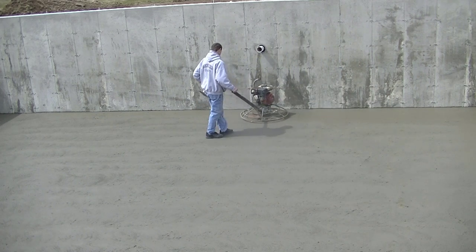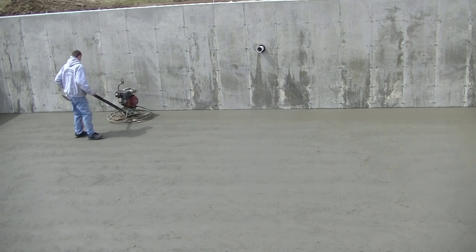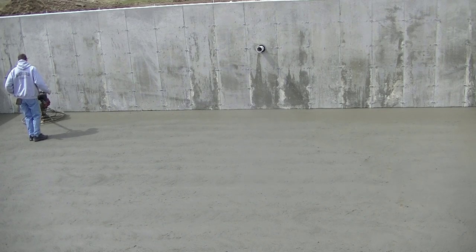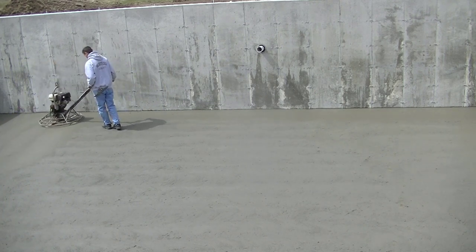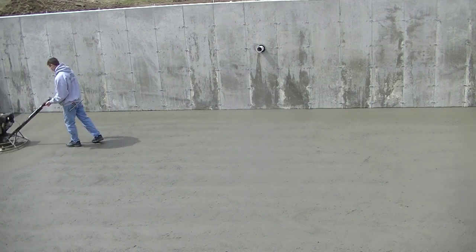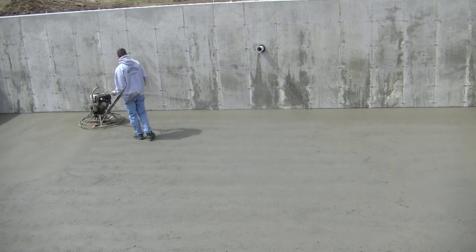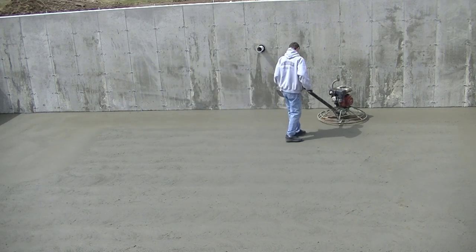Now here I am down there — we call the first hit 'float' and the rest of them 'lay down,' so I'm hitting it on first lay down now. That edge with the sun beating on the wall is actually really dry — a few more minutes and I would have been late, I would have had to sprinkle a little water on it to work up the cream, but I got on it just in time.